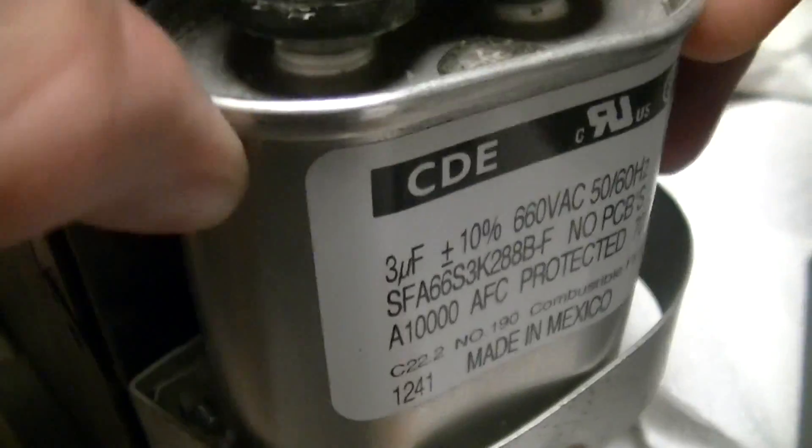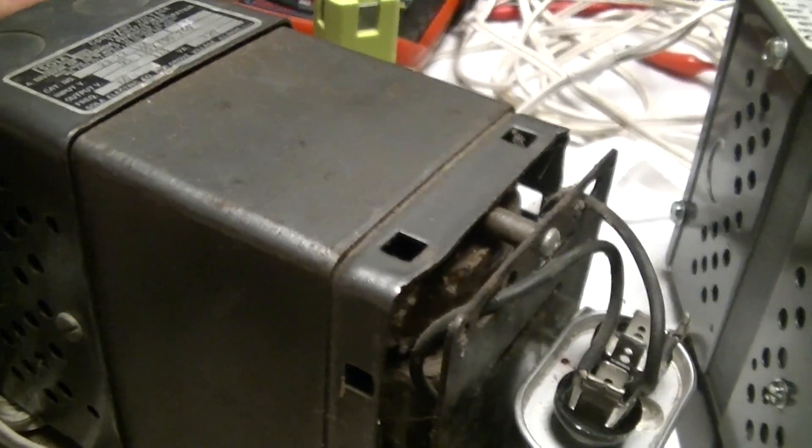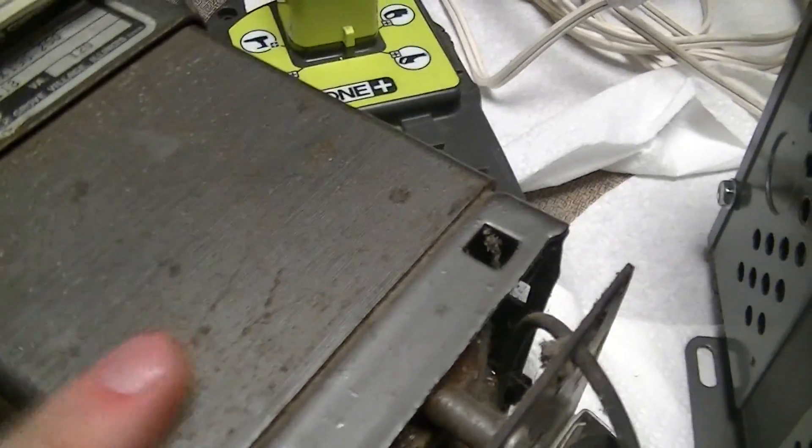Here's a video on a source for replacement capacitors for ferro-resonant transformers, which are not screamingly efficient. This 120 volt-ampere unit uses 30 watts and 40 volt-amperes with no load, because ferro-resonant transformers rely on partial core saturation — fairly lossy — but they make up for it by being a very reliable means of regulating AC supply potentials, even with their somewhat distorted output.